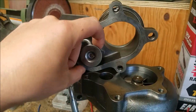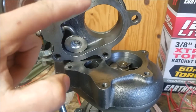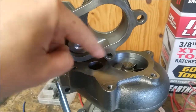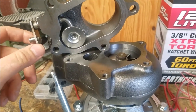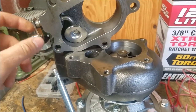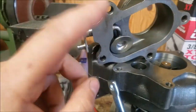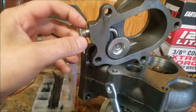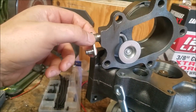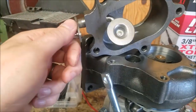We're going to cut this little guy off here and then put it on here and weld it. What I've seen some people do is — if you don't really want to take that off — another option is you could just cut it, tack weld it here, then cut off the end, and finish welding with all this force down on it.